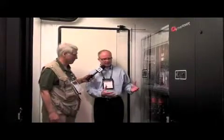We're in the final section of the power pod right now, and we've actually got two flywheel transfer systems, one with a glass front so we can see what's going on. We're standing in front of the flywheel UPS system, which is really the unique part — it allows us to get into a very compact footprint. We eliminate all those space-consuming batteries and the associated maintenance and replacement, and we put the flywheel system in here, which is your energy storage, directly replacing the battery for ride-through. It's a slow-spinning flywheel at 7,700 RPM — about 600 miles per hour tip speed — spinning in a vacuum, magnetically levitated, and during normal operation we continuously motor it to keep it within a certain speed band.